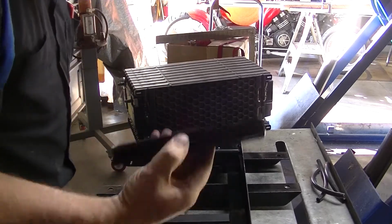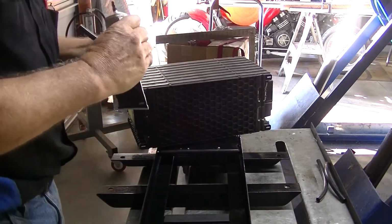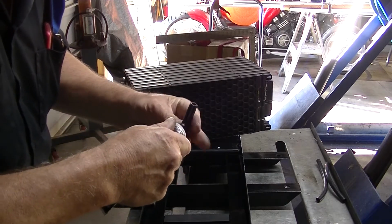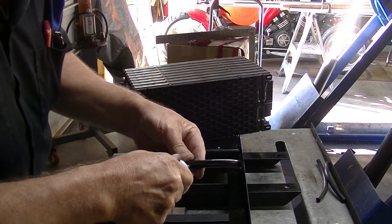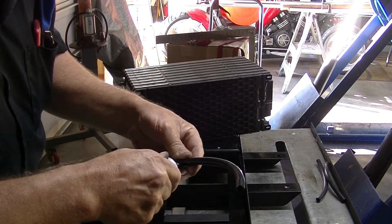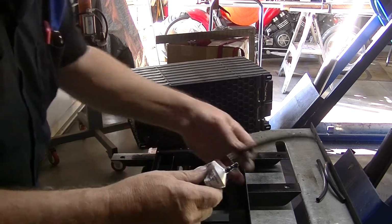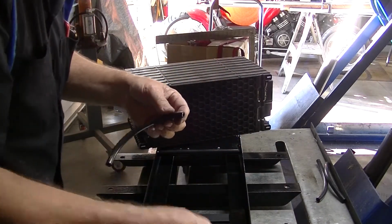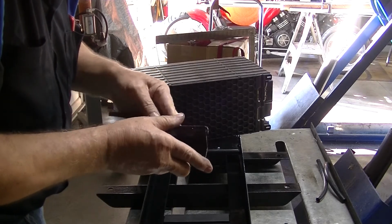And now my removable one, same thing. I'll put weather strip adhesive down the slot. This stuff is really good. When I was 16 years old, this stuff used to be yellow, or you probably still get it in yellow. I used this actually to seal an oil pan gasket. I cleaned the area real good and used this stuff, and the thing never leaked, ever. And it was leaking pretty good when I did it. Doing the pan gasket on that Barracuda would have meant pulling the engine.